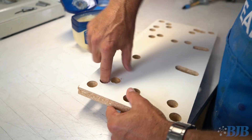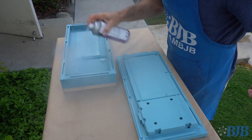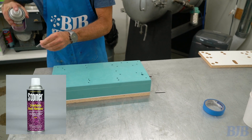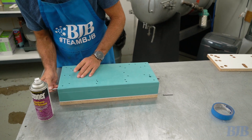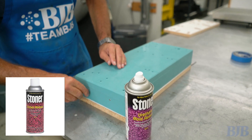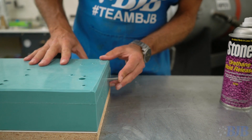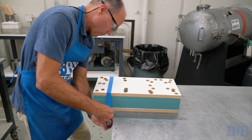Now to make a casting, apply one of our mold releases. To get the most parts out of your mold, use our Stoner Urethane Release E236. If you plan on bonding or painting your cast part, we would recommend our Stoner Rocket Release E302. If you made your mold with a high-gloss part and want to keep that gloss level, we would recommend that you do not use a spray release. Keep in mind that by not using a mold release, your mold will not last as long.